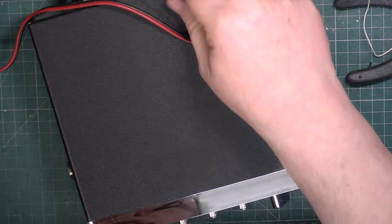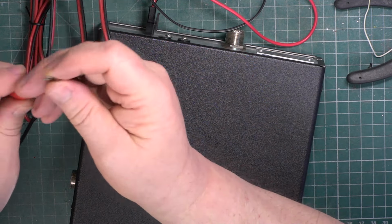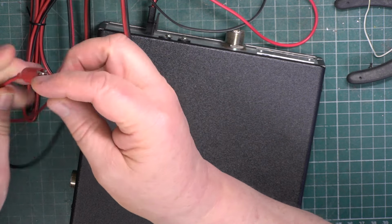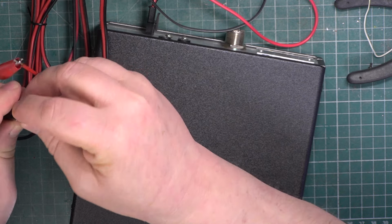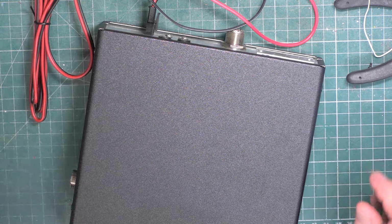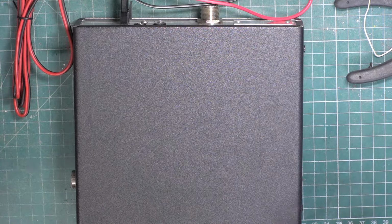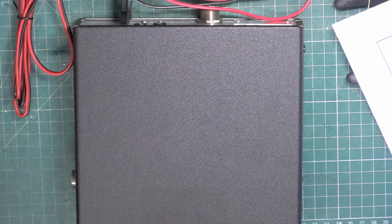Right, well, I'm not going to open it up yet. So the usual criteria: if we can get more than 3.6 watts out of it, we don't alter the ballast resistor. If we can't get 3.6 watts out of it, then we will change the ballast resistor. Problem is, it's a 3-watt resistor and asking 4 watts to come out of the set. So we'll use a standard Cybernet replacement mic, Cybernet 1002F chassis, did I say that right?